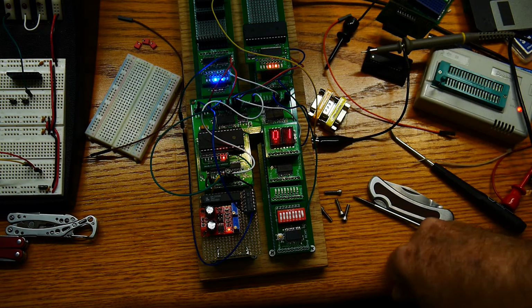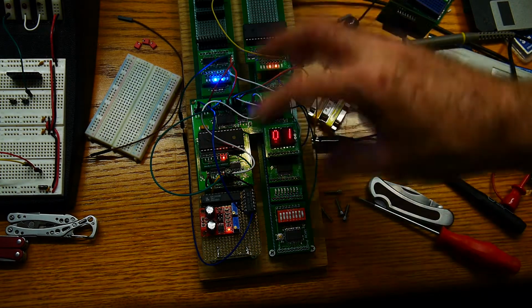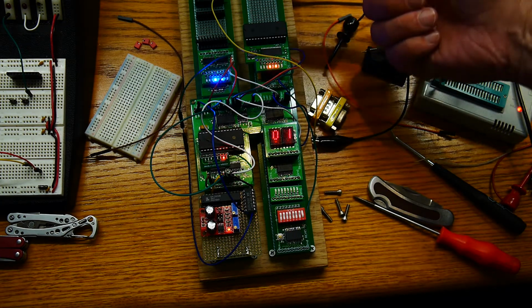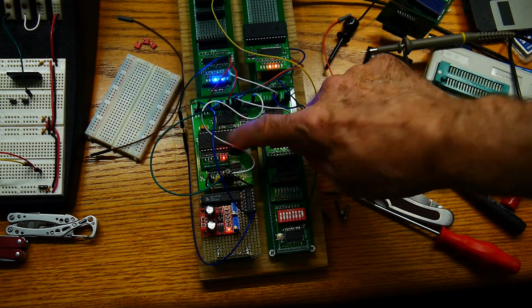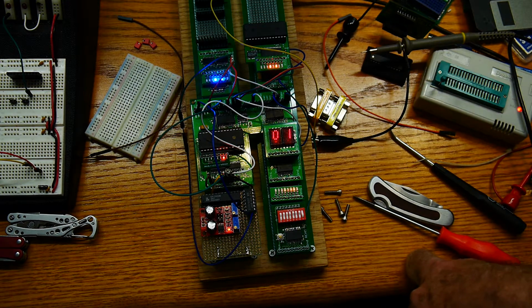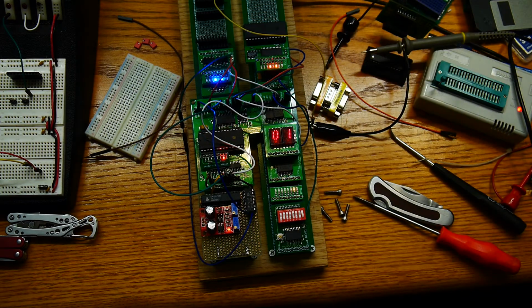So we could build a program that did what you needed it to do, and then had a bunch of no-ops in ROM until it got to 128, and then it would roll over. Much like what we did here, where every 16 instructions it rolls over. Here it would have to be every 128 instructions. Now that's not a very useful program. Definitely need to get the jump instruction fixed.